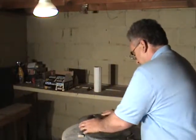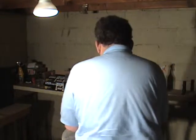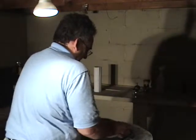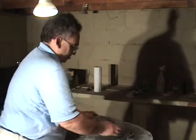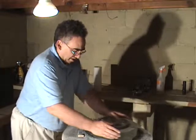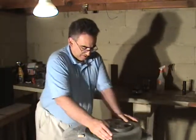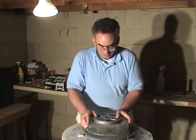One of the things you'll notice is that on top of my Parker barrel, there's quite a bit of what we call SWARF — S-W-A-R-F. That's the excess grit that's pushed off the edge of the mirror during the fine grinding process. You can use it again, no question about that. I'm not right now — I've got a load of number 80 here and there's no real need at this time for me to reuse it.